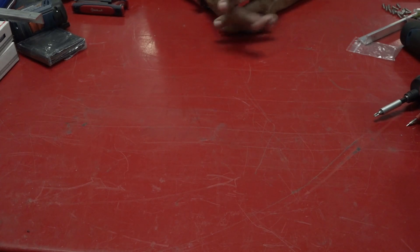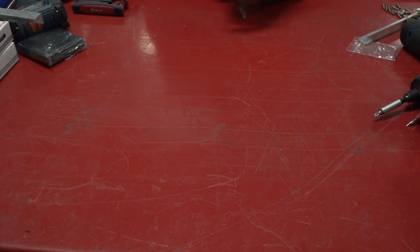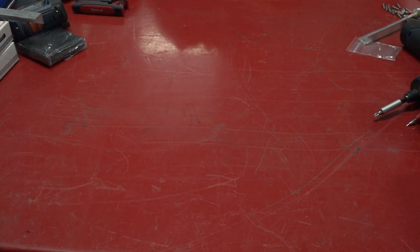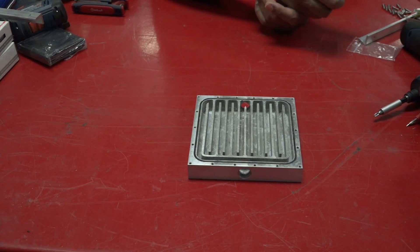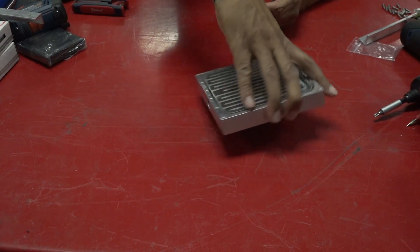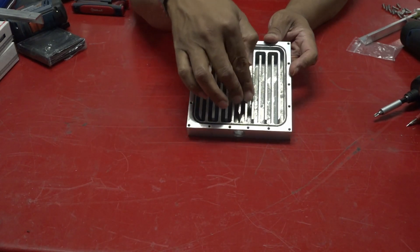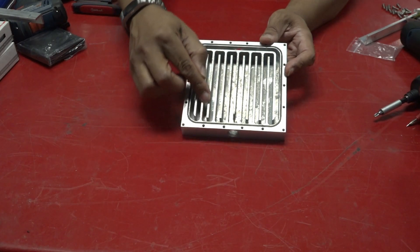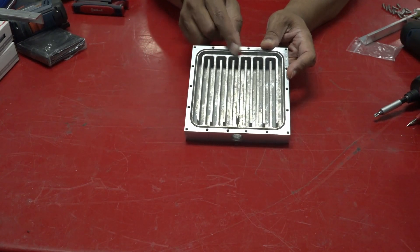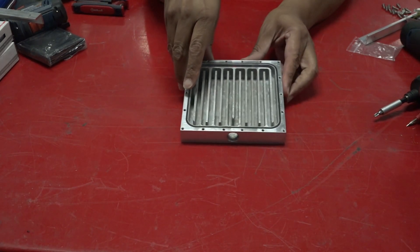It's not even a real water block — it's just a piece of aluminum slab with a hole going in and turning around and going back out. That ain't gonna work when you try to do a bunch of them. Here's what I'm going to go with — I've been using it before. At first I thought I could only cool one transistor with it, which would have been kind of stupid. But actually, from your angle — that's the input — you can see what it's doing: input comes in and splits right up, down, up, down, up, down, and out the other side. Does the same thing on both sides. This unit can easily cool two transistors.